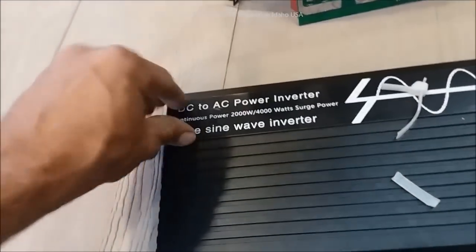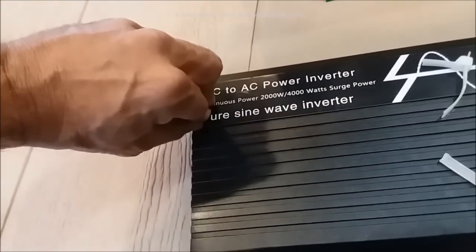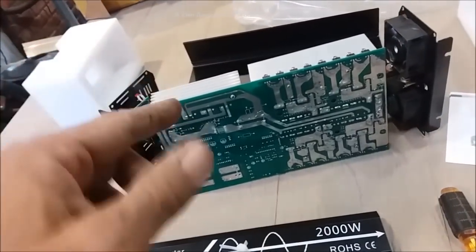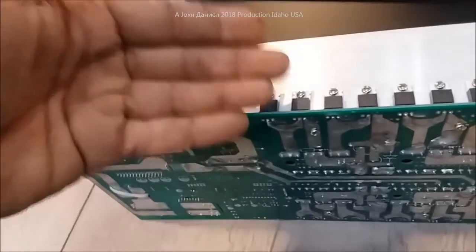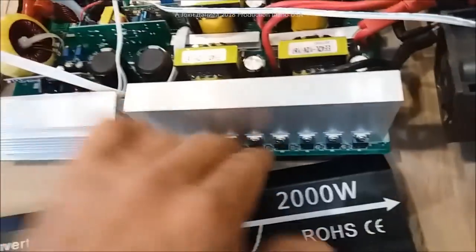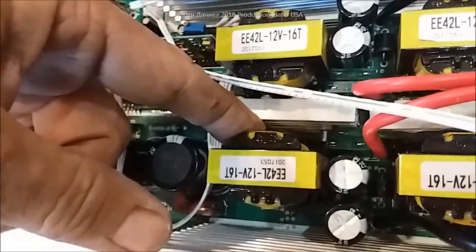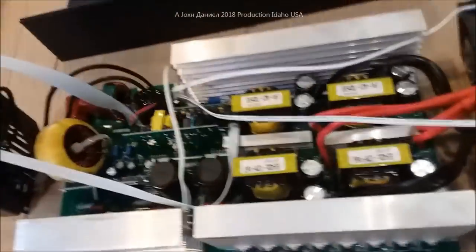This relabeled unit — you can probably peel off the sticker and find another brand under it — and it's probably going to work when I do the repairs. The MOSFETs look like a decent grade; they're not Fairchild, not IR, nothing special. The transformers look half-decent quality. When I put a piece of rubber down on the tip of that bolt I'll feel a little more comfortable, but the assembly quality is another story.